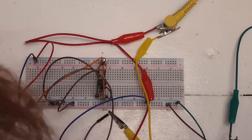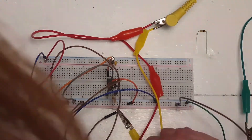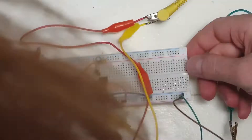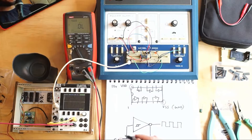In retrospect, I should have tried a different chip in case this one was faulty, but after about an hour of troubleshooting with no luck, I decided to give up on a circuit based on the 555 and instead go for a circuit I was more familiar with, based on an IC called the CD40106, which is a hex inverter circuit that I've used before and is one of the easiest ways to make your own oscillator. There are a few good resources on YouTube, especially a video from SynthDIYguy in which he details how easy it is to set up the CD40106 as an oscillator.